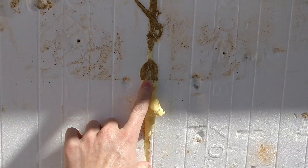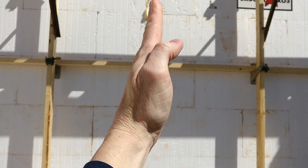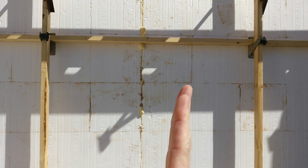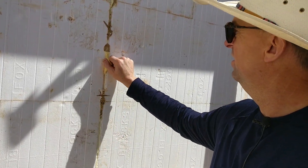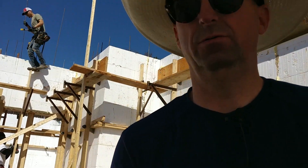For the purposes of our bracing you can actually screw and put your braces into it as well. This section right here is called a stack joint — a common joint that runs right up the middle — and that allows you to either squeeze the walls in or spread them apart a little bit to make sure everything is straight. Once you get that set, you put some spray foam in there about a quarter of an inch, then put the OSB over it to keep it from running out. When you're done, you pull that piece off, smooth it off, and the drywall will go right against that.